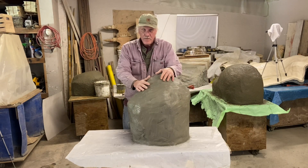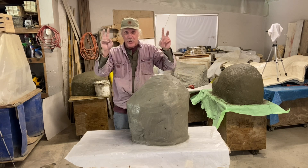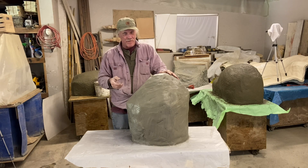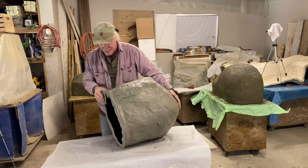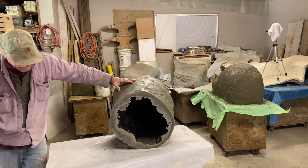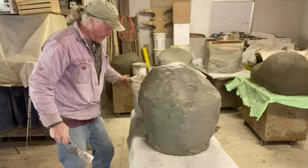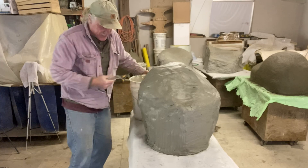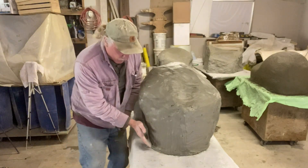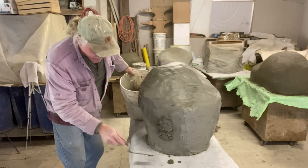The mud is really green — this is from yesterday, about 12 to 14 hours since I made it. It's still not cured, it's very soft, but I'm going to move this rock and I don't fear it breaking at all. I wanted to show you the lightweightness — one coat is very strong. The bottom is ridiculously thick because the mud got through from pushing it. I'm also not liking the vertical edges, and I have a little bit of styrofoam mud left that I mixed up. I want to throw it in some areas to create a little more of a round on that lower edge, then coat over it with the mortar mix.